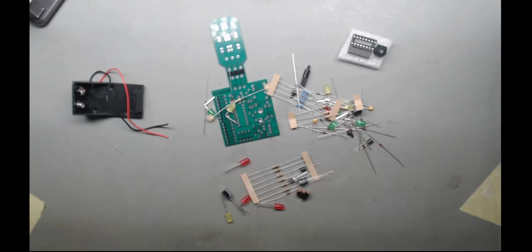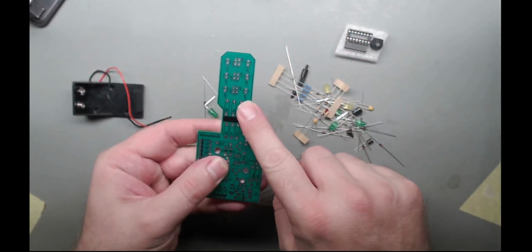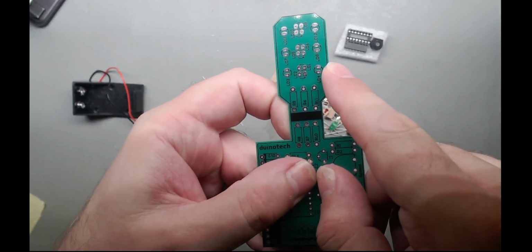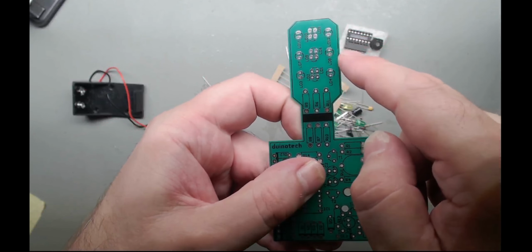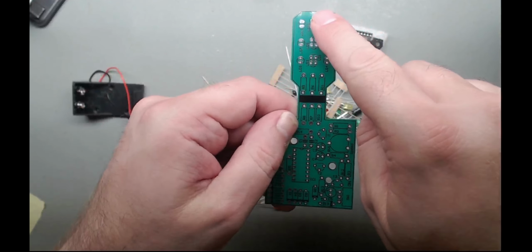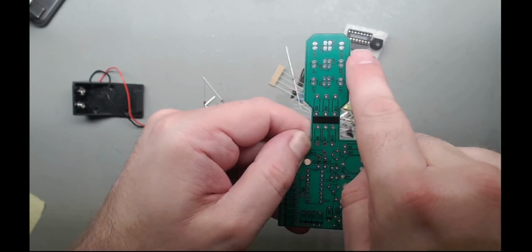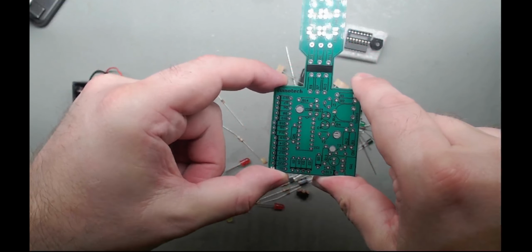This one's an interesting one. So, look at the top of the circuit board. Right, you've got a series of LEDs. Funny enough, red, yellow, green, facing that way, up and down. So I have to solder on both sides. So that's your traffic light bit. You've got your six here because you've got 1, 2, 3, and then your two directions. So that's your six combinations of LEDs, and then you have the logic board down here.